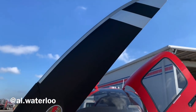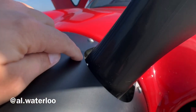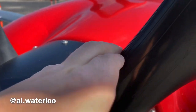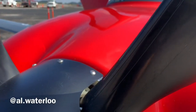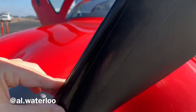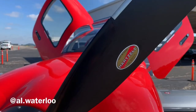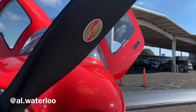The prop tips are great. Right in here are our de-icing pipettes. The de-ice fluid actually flows out of this little pipette into these channels on the boot. A lot of people think this is an electronic boot, but it's not — it's not electronic de-ice heat. The fluid literally drips into these channels, spreads out, breaks the ice off, and ultimately sprays it back onto the windscreen. It works really, really well.